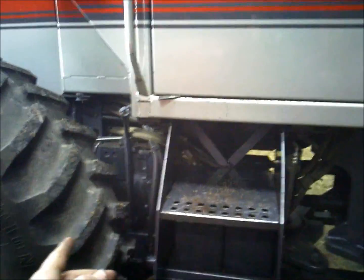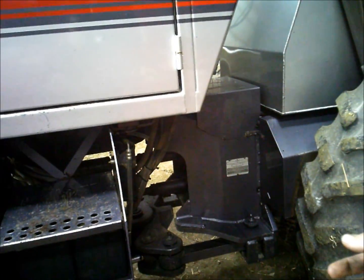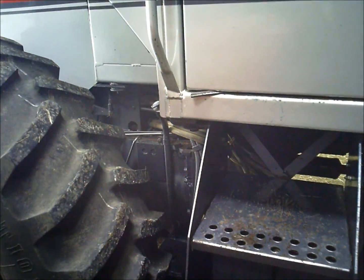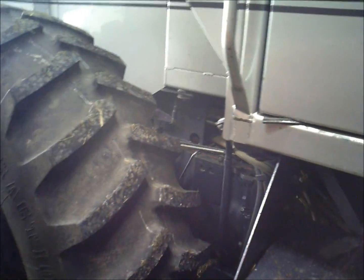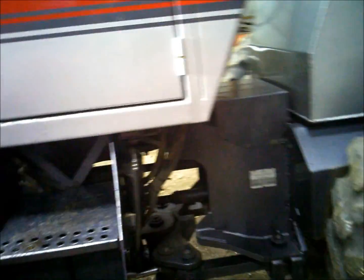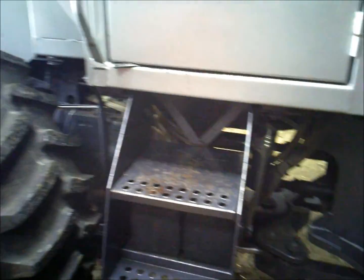Yeah, it runs hydraulic out of a common reservoir between the front and rear axle housings for hydraulics. Transmission's up here in the front, and it's just got the regular differential back here. So that was that dipstick, but you can't really trust that one too much because there's a transfer pump in there, and it just kind of depends on where it's at as far as moving oil between the two housings.